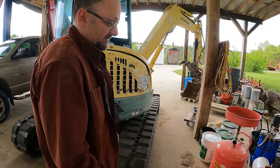Of course, I have to draw it out. A real hydraulic mechanic would probably be like, oh yeah, duh. So if it was the swivel side, you wouldn't expect it to be flipping like this. If it was leaking in here, that motor would just be lazy. So hope that made sense. This is really pointing to that left control valve.